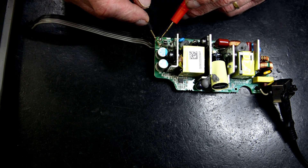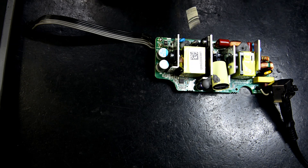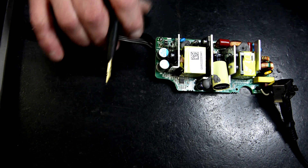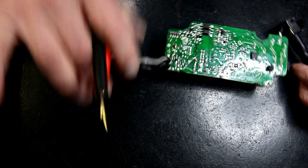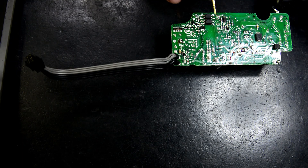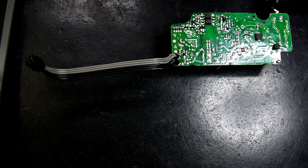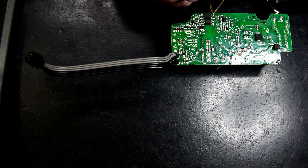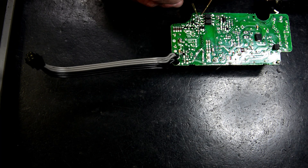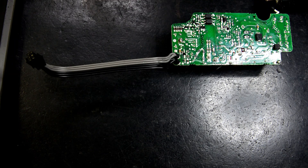Once again, we'll go to our output voltage — 12 volt. We've got nothing. Nada. So that's gone. The most common problem with a lot of power supplies is the chopper transistor, diodes, capacitors going shorted. There's another point we can check — these opto-couplers here. If these opto-couplers don't work, they have a voltage coming in, usually about 0.6 volts, and a DC coming out. If there's no voltage coming in, they're not going to get an output. And we've got nothing there either, so it's looking up around that area.